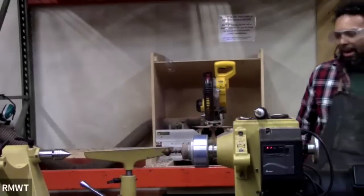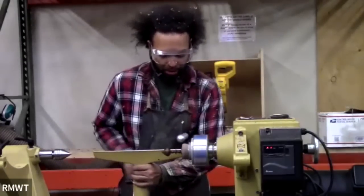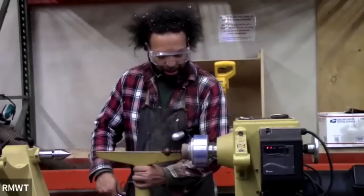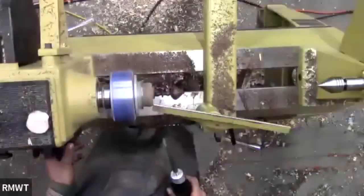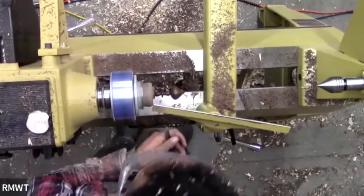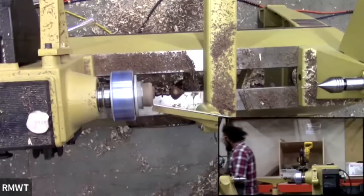So I'll go ahead and take the half inch right in front of my face and remove this piece. It's one of those things where it's a novelty item more or less. So if it doesn't spin, it doesn't break my heart, but I think it will. I hope it will. I think it'll be okay. And I'll go ahead and slow this down just a little bit more from the speed for buffing, in this case, 1800 is good. Downhill shear cut. Let's make the last cuts count.